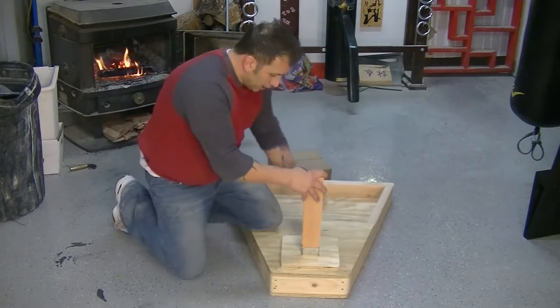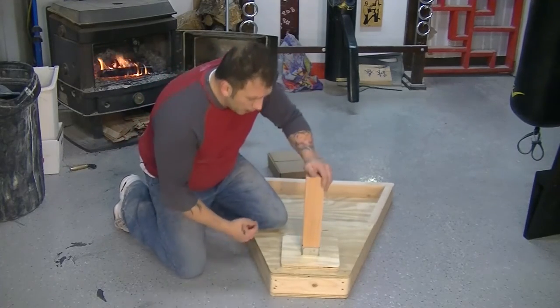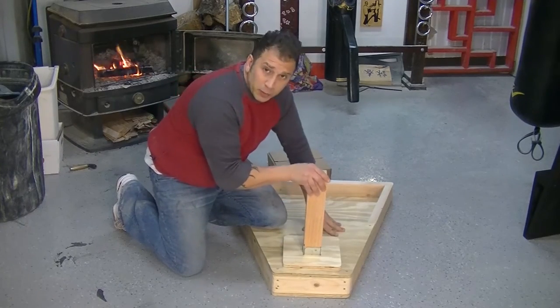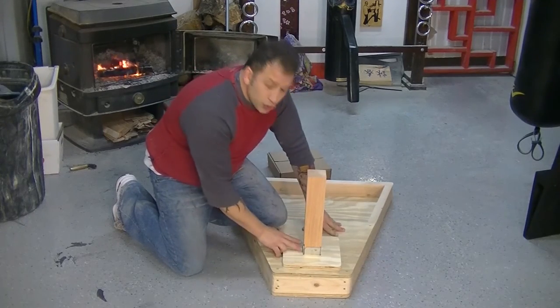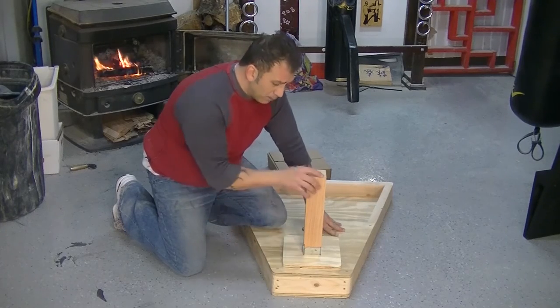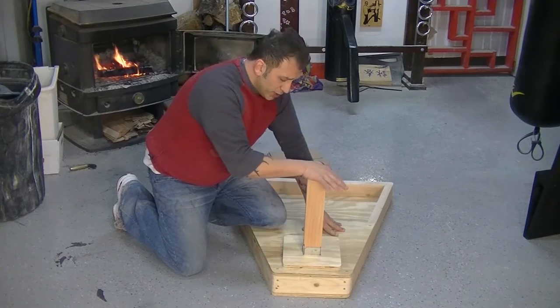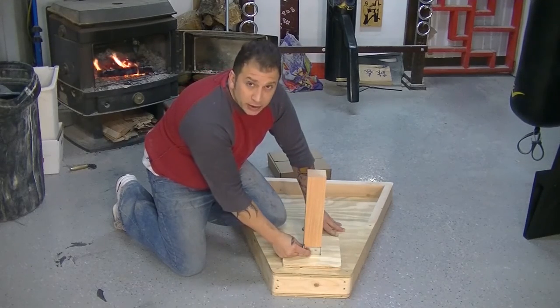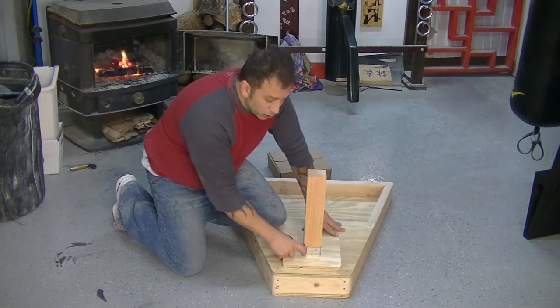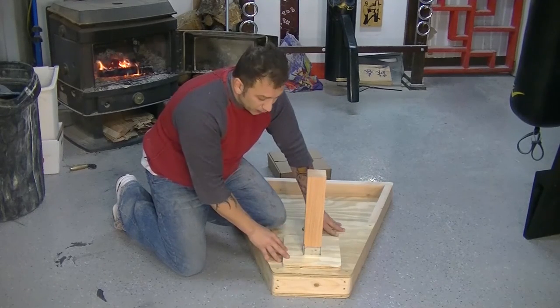As you can see, even without putting the leg bolt to the bottom, this is very secure. There's very little movement in it, but there are no screws now that can possibly snap or break. The leg bolt isn't in the bottom, but you can see this is a tight fit and it's in steel, so we don't have to worry about the wood wearing out — which was originally my concern for why we put brackets in the first place.